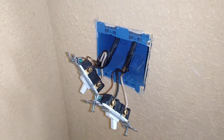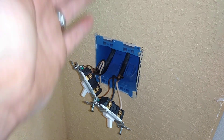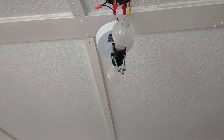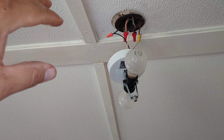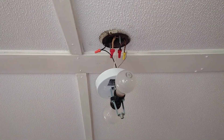Basically what this system does is it moves the junction of your power feed out from the switch box and puts it in your light box — that's basically all you're doing. It cuts down on wiring costs. They just ran the wires up here, all the power stays up here, and you don't have to dip it down into the walls and go over the doors and all that. You just run it straight through the ceiling.